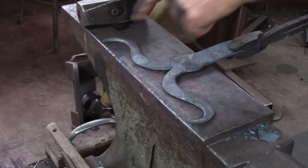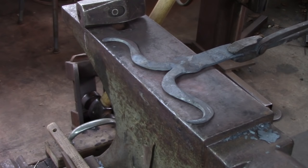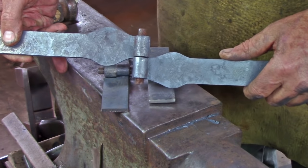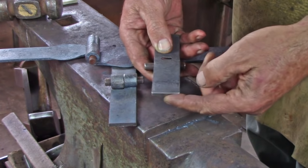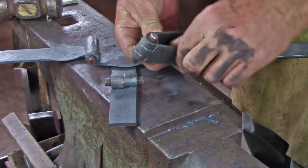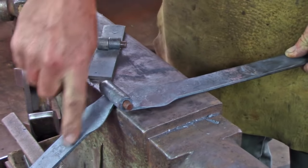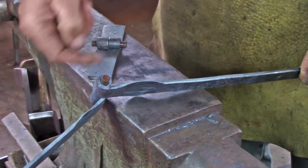Remount your horns to the edge of the anvil and check that the head is perpendicular — sometimes when pulling out the cheeks for the face you can move a horn, so make sure those are correct. There are a number of ways to arrange the hinge. I've got a three-knuckle example and a two-knuckle example; what I intend to do with this project is a two-knuckle arrangement where the hinges are just staggered. The amount of clearance you give at the back will dictate how far the hinge can open — this one with no clearance won't go past 180 degrees. For my project, a log bin, I need about half an inch of clearance so the bottom piece can move around without impedance.